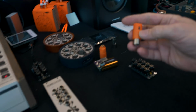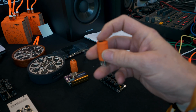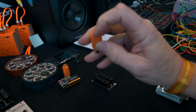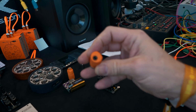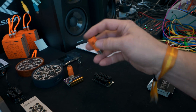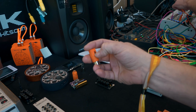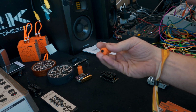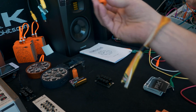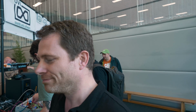And we also have small little tools like this. What does it do? This is a plug. You have the newer MIDI devices which have the mini jack connector. But there's not really a standard in it. I think Korg has one polarity, Arturia has the other, so we just made a thing like this with a switch on it. You can just use a stereo audio cable, plug this on one end, and you have your regular MIDI out. It's all little solutions for portable setups.